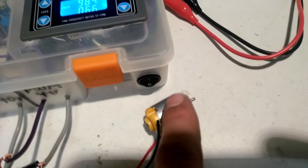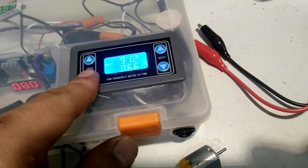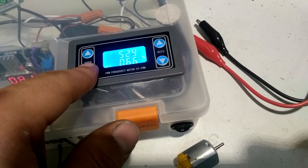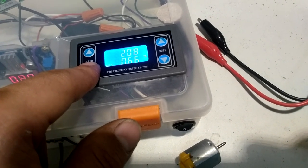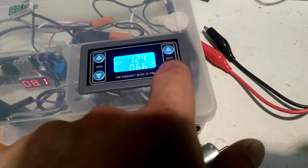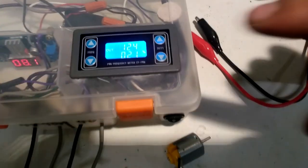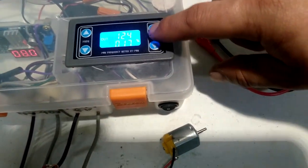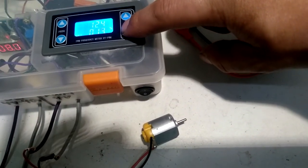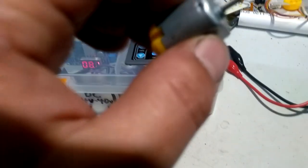Some interesting ringing going on in there too, some sounds I can hear. So we're back in the more motor-reasonable frequencies. There we go. Leave it right about there. And there you go. You can bring the duty cycle all the way down now to a more reasonable level. We have a wider range of control given this motor here. Right around there, it stopped.